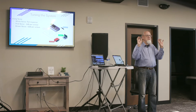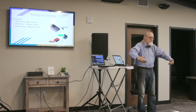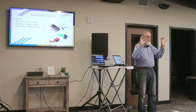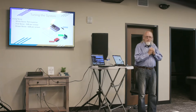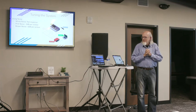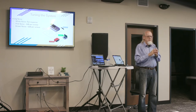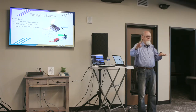And the thing with line arrays is you have to have computers driving them. With line arrays, there are actually a whole bunch of speakers in arcs, right? And you have to tune them so they act as one speaker. And it was phenomenal. He tuned it all up by running white noise through it. We'll talk about the different kinds of noise that's written up there, but he ran noise through it, and he got it so that it was a flat frequency response across the whole spectrum, okay?